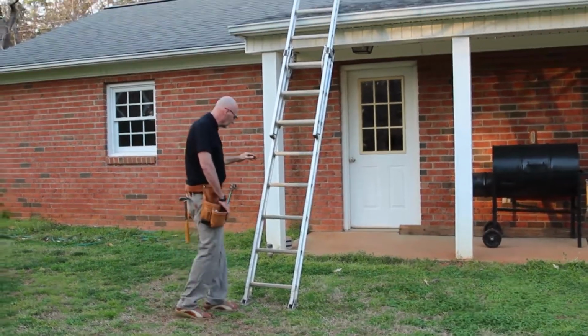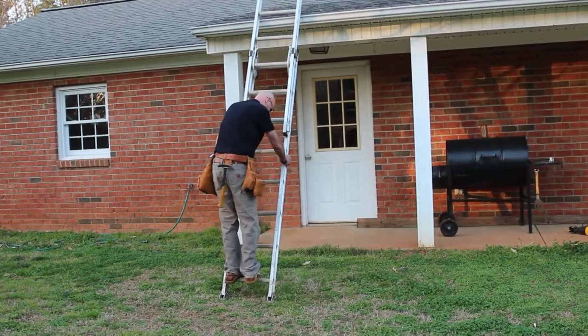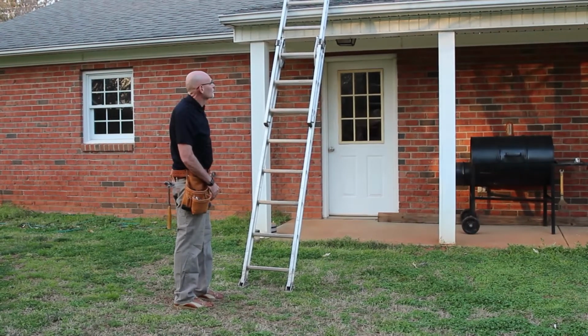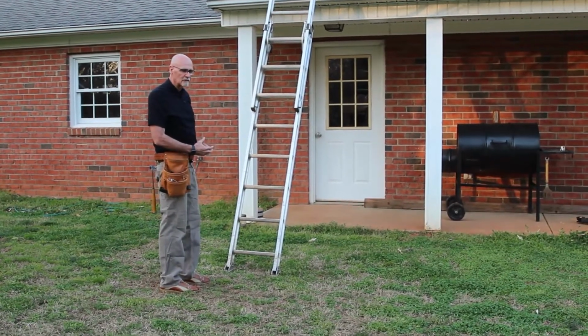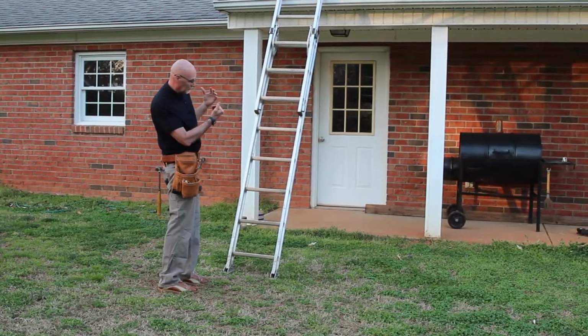The key thing here, guys, is to make sure it's grounded. You're in the ground, check it. It looks good. I'm only 1 rung on. They're spread a foot apart again. I'm 3 foot above. I'm going to go up this ladder to the top of the roof, take a look at it, see what I've got, and then I'll come back down. Again, make sure you keep your hands on the ladder. Don't lean side to side again, and do not lean back.